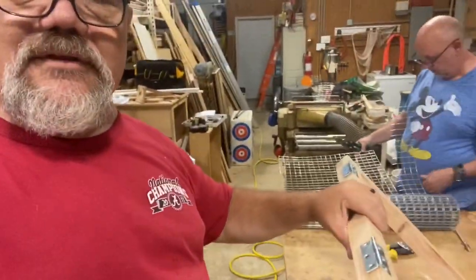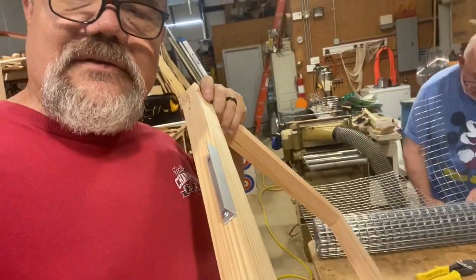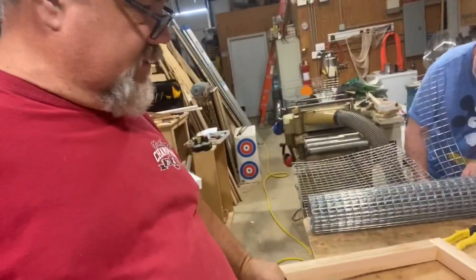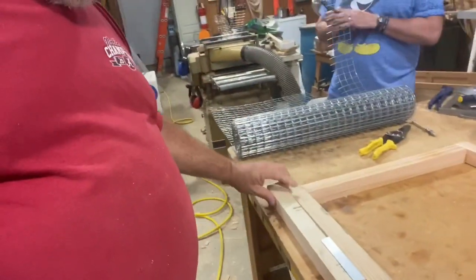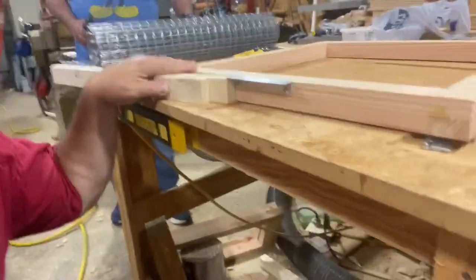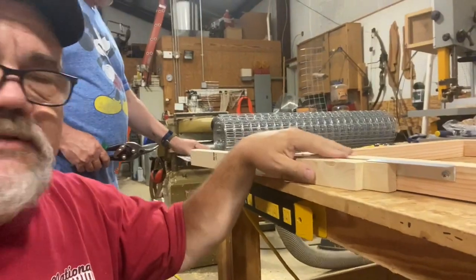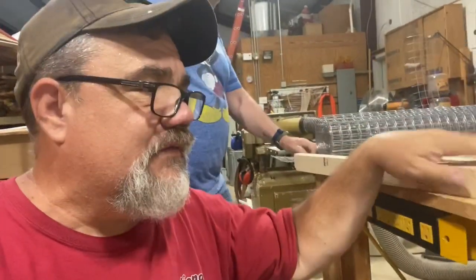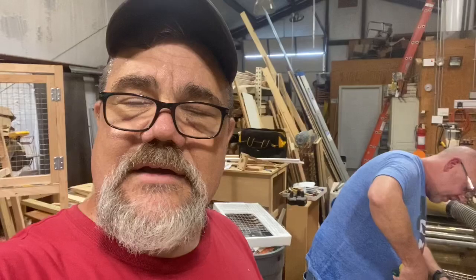Right now I just put the hinges on one of the doors. So this is one of the doors — I put this piece of aluminum angle on it, supported by two other inch-and-a-half pieces of wood so I could put the screws in. I just cut a piece of about five inches of aluminum angle, drilled some holes in it, and screwed it in. What will happen is this will sit in the top frame assembly and everything will sit flush because of this little piece of aluminum — that's what's going to hold it all together.